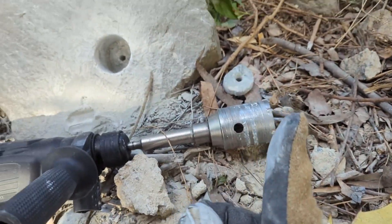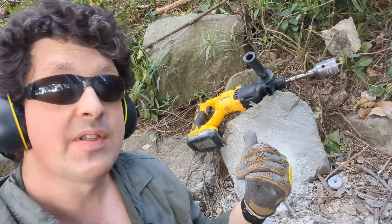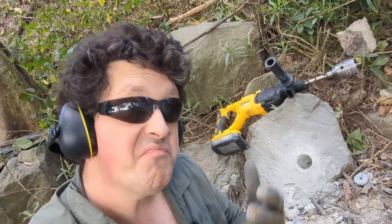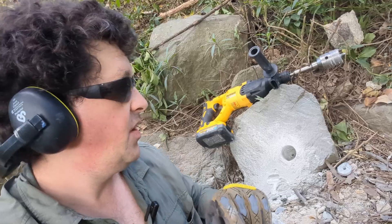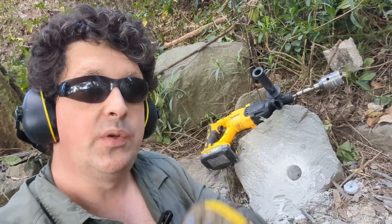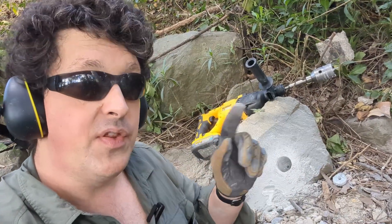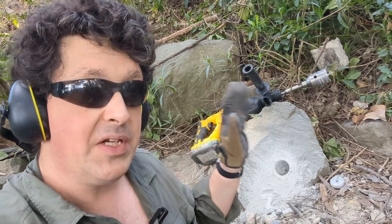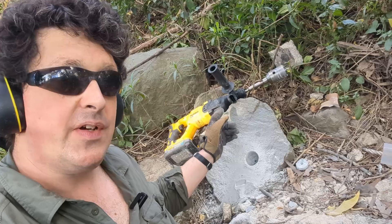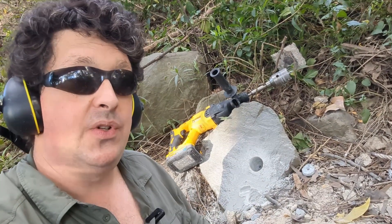I'm going to call that a success. I hope I never actually have to do that for a real job. I've actually got a few bigger hammers that can hit harder and will be able to do the job easier. But if you've got a one-inch hammer like this one and you've got to drill really hard rock, I think that'll work. It definitely helps to do a bit of pre-drilling. I would say scour the surface first with the core drill just to make sure you've got your circle, then go in with a much smaller drill bit and drill around the edges — that worked no worries. But be careful: if you're using this drill in particular, watch out for binding. It does not have kickback control, so make sure you use the side handle and make sure you're braced, because it's really easy to catch this bit on the sides of the hole. It's definitely a skill you would just get used to. If you've got a mid-sized hammer like a one-inch hammer and 25 bucks, you can probably do it. But if you want to do it easily, go and hire yourself an SDS Max drill and that'll probably do it a lot quicker.